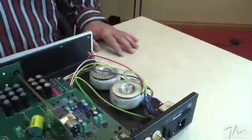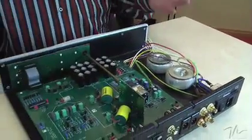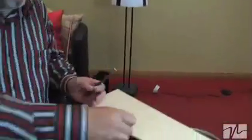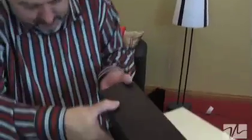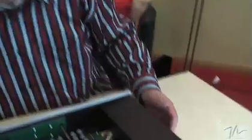Let's go back to this one and see what we can do to give it a little help. The biggest problem is that these transformers are sitting wide out in the open, so their electromagnetic fields are going to be going everywhere inside this chassis, saturating all of this area and causing sonic problems. Fortunately, this particular manufacturer has already built a fence for us. This fence is very effective because it's actually made out of steel — my magnet will stick to it just fine. Because it's a ferrous material, it does an excellent job of protecting these transformers from having their magnetic field escape. You could go even farther and clad that with copper — copper and steel together would make the ultimate cage for protecting the transformers against the rest of the circuit.